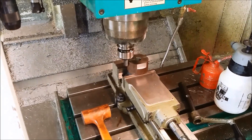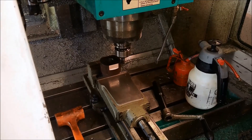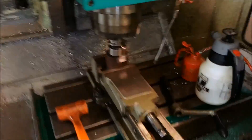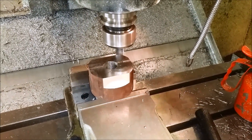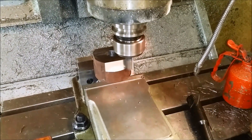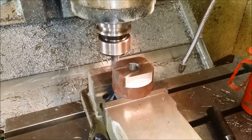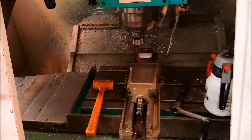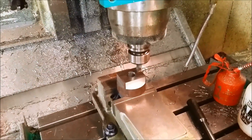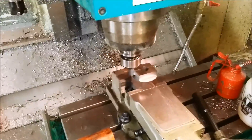Just loving those chips flying — ain't this awesome! I really need a machine like this myself. We're taking a 20mm DLC, 2.5mm depth of cut, 3000 RPM and 1200 millimeters per minute feed, and I'm still using only less than 50% of the spindle power. So even though this is a very little machine I think it's pretty capable. For now I don't want to push anything any further — not the end mill nor the milling machine.